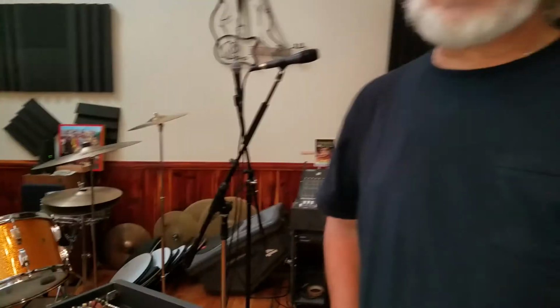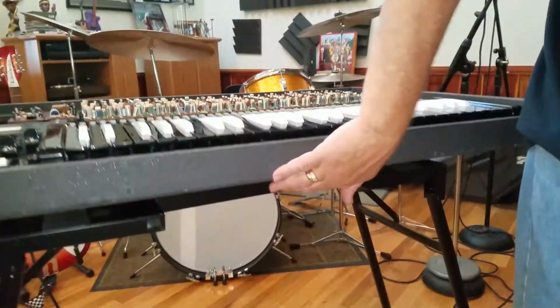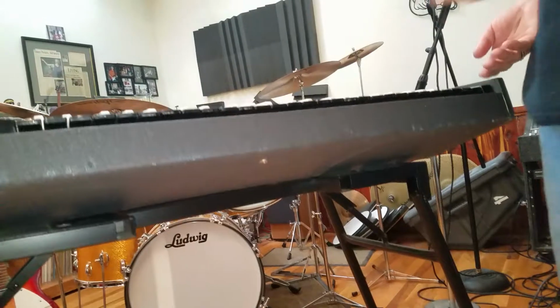And that indicates that there is another key that isn't properly hitting the ground bus. So the contact on another key is not contacting ground, so there's leakage through there, and then you're picking up that note. So we'll take one screw out for the Italian versions in the center so that we can lift the keyboard up.